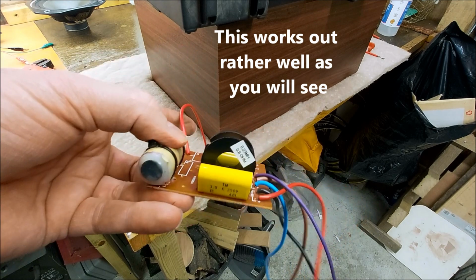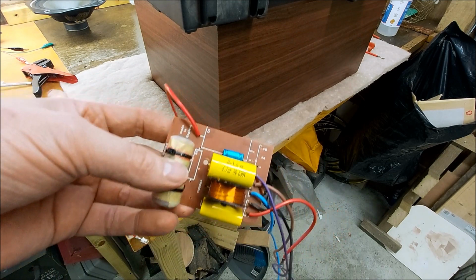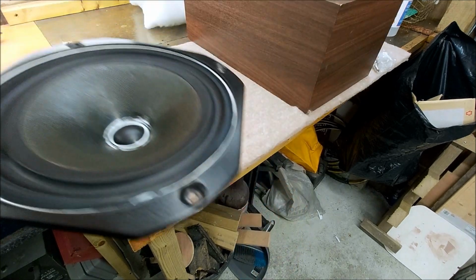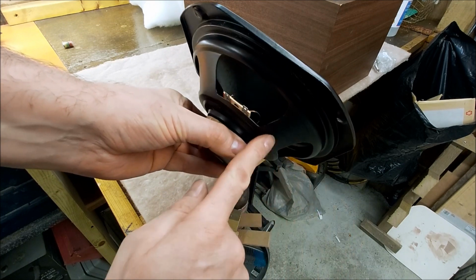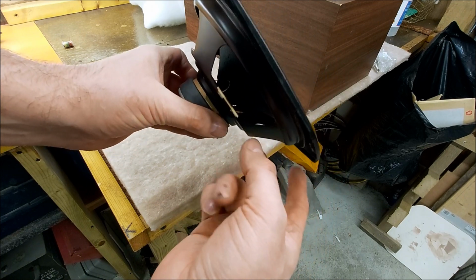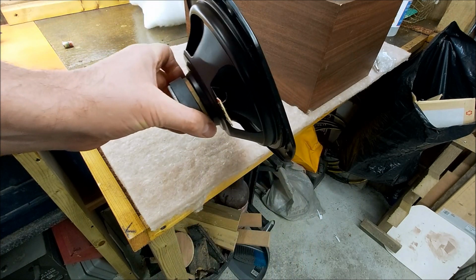So what I'm gonna do is reassemble this speaker and then measure it. Just quickly throw some sweeps at it and make sure we haven't thrown it out. And if it's all good, then we'll do the other one. So the other thing I'm going to do to this woofer is stick some neoprene pads on here just to try and get rid of some of that ringing, because I am dead sure that you'll hear that even when it's fixed down. Yeah, it's not going to hurt.